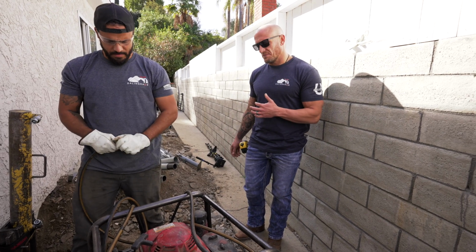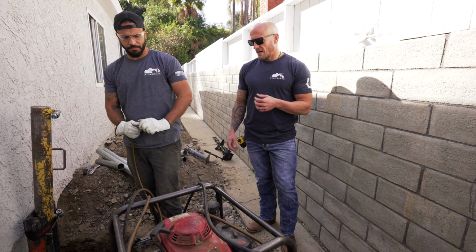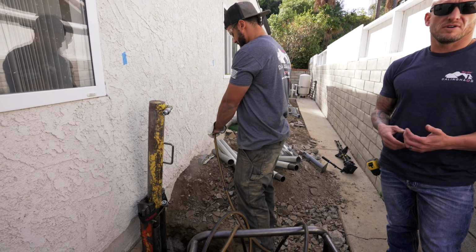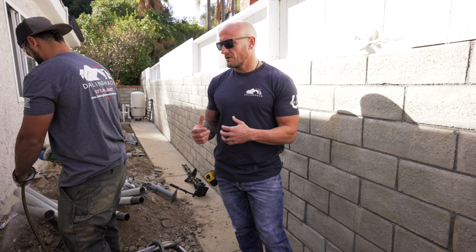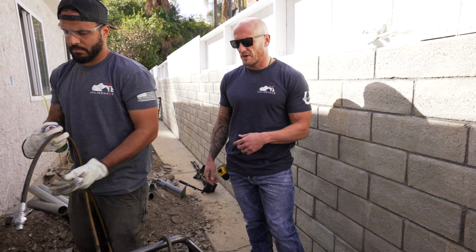All right, now we're going to hook up our hose assembly from our pump to our ram system. The fittings you want to make sure are cleaned out. We use brake parts cleaner to clean the end of them. Any dirt that's in there can have a leaking effect to that joint or that fitting whenever it's tightened up and you start getting pressure or fluid running through them.